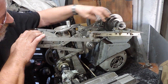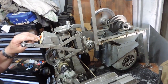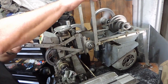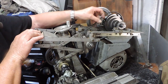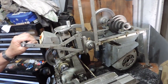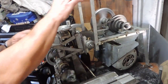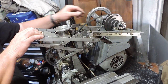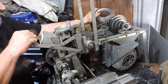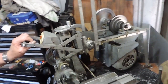That is 88 RPM — I'm hoping that's correct by this small electronic digital RPM tachometer. So it says 88 RPM in low range on the secondary transmission. Let's go up a notch — that's 160. Up another notch, this is 3rd here, that's 290 RPM. These RPMs are the spindle speeds. And 4th gear in low range, that spindle speed is 535.